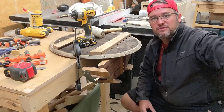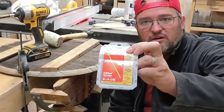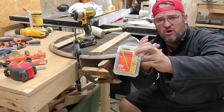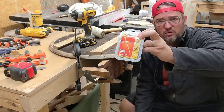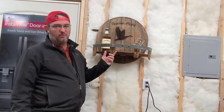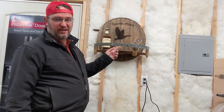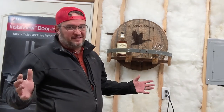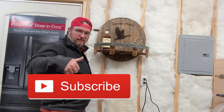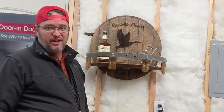Now that I've got a couple of screws in the back I'm going to put five or six more. The screws I'm using are three and one-eighth inch GRK cabinet screws — they have a big washer on the back and they'll be plenty sturdy to hold this shelf. And here you have it — your very own whiskey barrel whiskey shelf. Bob, I hope you enjoyed this video and get lots of use and enjoyment out of this shelf. I can't wait for you to have me over for a drink. Subscribe below, click the like button if you like the content so YouTube knows I should make more stuff. See you next time!